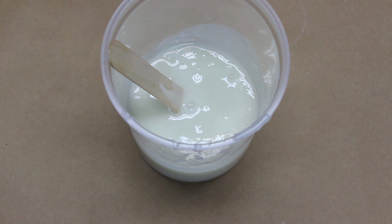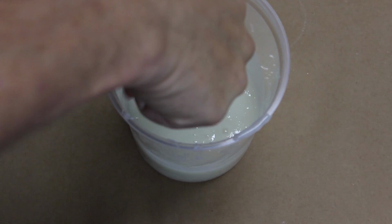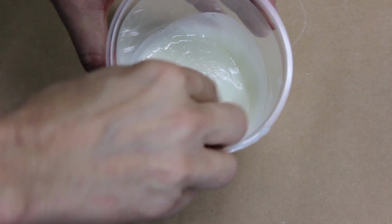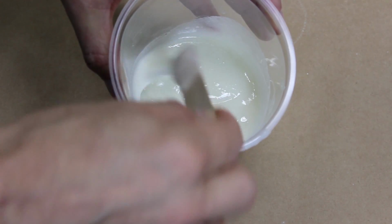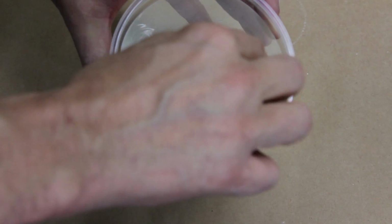Allow the material to sit for a few moments for loose bubbles to rise where they can be picked off. Once the gelatin foam is remelted and refined, you are ready to add any tinting you may decide to use.